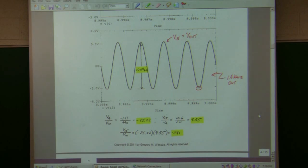Surprised, I expected it to be closer to 5 watts before it started to clip. What I did then was I went back and started to calculate the biasing point of the tube and the turns ratio of the transformer, and figured out how I could increase the power by this intersection of AC and DC load lines. I didn't try to write it up because it gets kind of mathematical. But I went in and made the changes based on what I could measure and in SPICE. I was able to get 3.5 watts out of it. And I'm not really at full power out because I just have to change the biasing a little bit more. I could squeeze out maybe 5 watts.